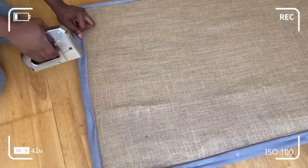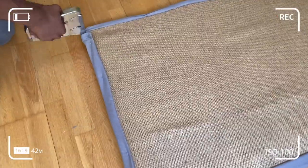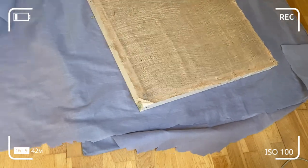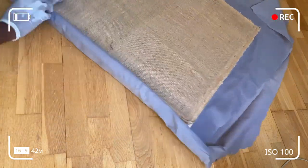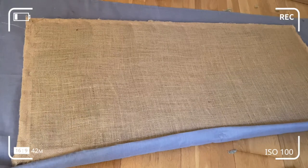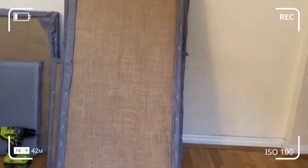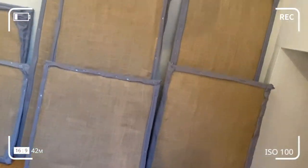You don't need to apply glue at this stage. When using bed sheets or cover sheets, you want a material that breathes air through it — if you can feel the air on the other side of the bed sheet, it's a good material for fabricating your acoustic panel. You don't need to double down on your bed sheets; I'm only doubling here because this material is very light so that the staple doesn't come off easily, but it's still breathable. I've repeated the process for other panels, trimmed them accordingly, and these are all the panels that have been built.